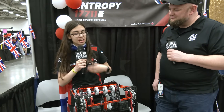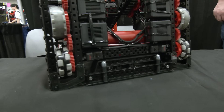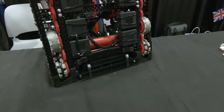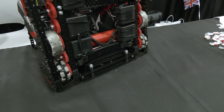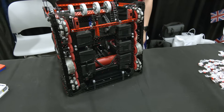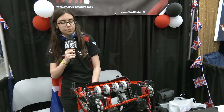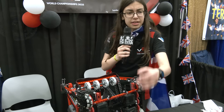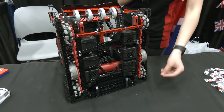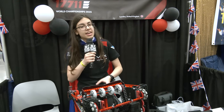In addition to this precision-gathering setup, we have a double IMU on the bottom. This is done using a custom class within our code base. The custom IMU takes the geometric mean; however, this is inaccurate if one IMU drifts, because it won't result in an accurate measure. A double IMU adds more precision because an issue I had early season was that the IMU drifts — if it's an old IMU it gives more and more inaccurate readings over time. So you account for that in code: if one IMU is drifting, stop reading data from it and just take the result from the other IMU.